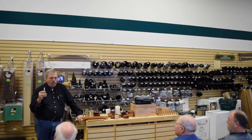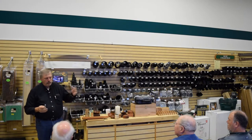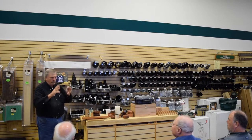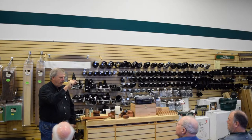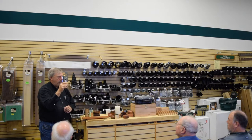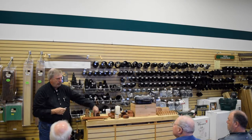I make crystal goblets with wooden bases. And I order bunches of them, and they're beautiful crystal goblets. You can get different sizes, and there's a little stem on it that's that big. And that's what you drill down into your stem that you're turning. That will hold that goblet in there forever. But if the wood expands and contracts, that goes with it, and it doesn't put pressure on the crystal and crack it. Does a great job with this too.